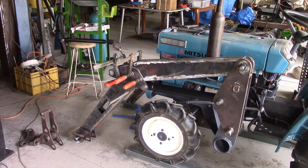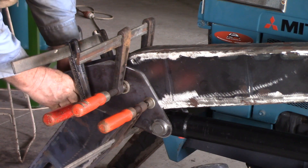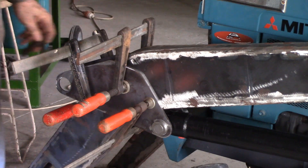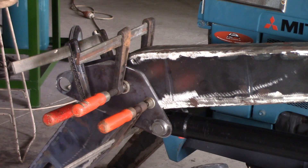I've got those two side pieces lined up perfectly now. I'll show you how I did it — could be better ways, but I've got one of my machinist squares and I just went all around it and made sure they were all lined up, particularly across these holes here — that was a critical part. Now I'm going to go ahead and tack that in place and tack those two plates down on the bottom. The elbow plates are part 029, the wrist plates are part 032. I'm going to get them all tacked on now, then start assembling it again to make sure it's all going to work. Before I weld anything entirely in place, I want to have the whole arm assembled and prove that everything is in place and going to work exactly as planned.